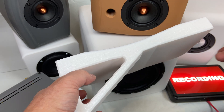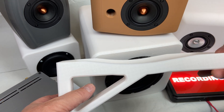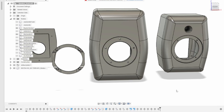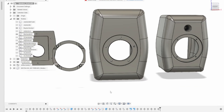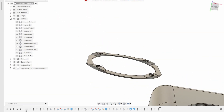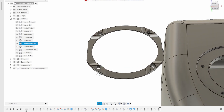To complete this project, I printed a couple of speaker shelves, and also a 20% larger version to fit the larger Mark Audio enclosure. I spent a lot of hours in Fusion with this project. Sizing the box was easy enough, and removing the vent was easy too. I then designed a retainer ring for the nylock nuts to keep them in place, making it a bit easier to install the driver.